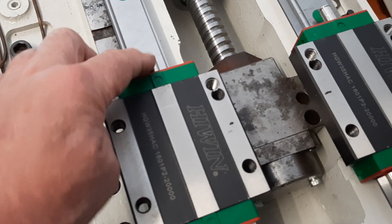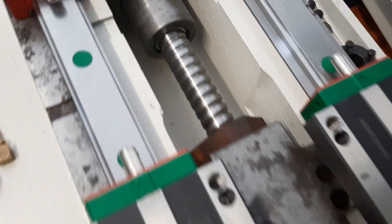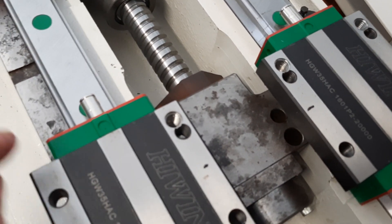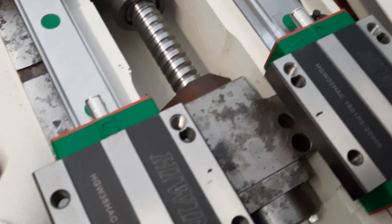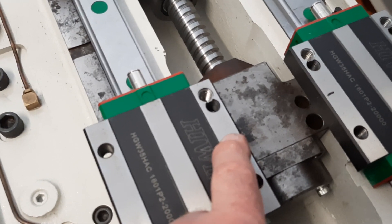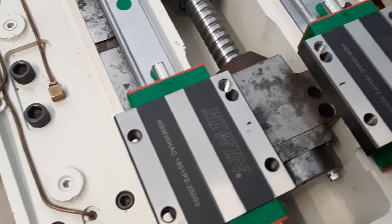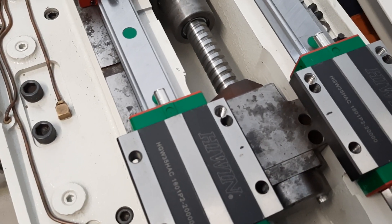I utilized the actual fittings but I had to cross drill on an angle, because of the way the Hiwin setup is. You can see the different profile there - the race is very high up, one of the return races is very high up running through this case. It wasn't as simple as just setting it up in a vice and drilling across. I'd have to drill across at a slight angle to actually port it to the centre and then port it out to the ends. Thinking that was just way too much mucking around, so I've gone with that manifold setup.